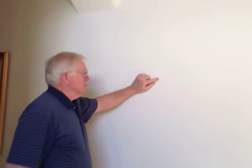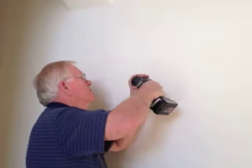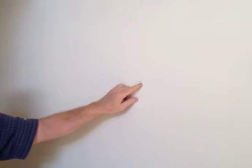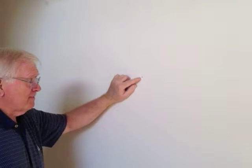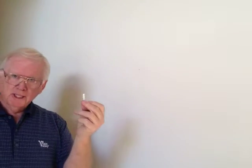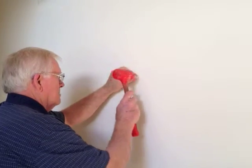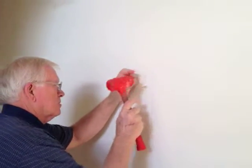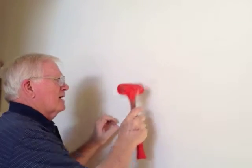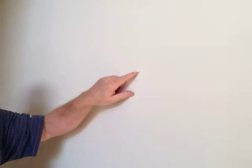Select the spot on the wall. Take your drill bit and drill it out. Notice that was complete sheetrock. If I happened to hit a stud, I would not have to install this piece that comes with your kit. Since I did not, I pound that piece in until the threads engage the sheetrock.